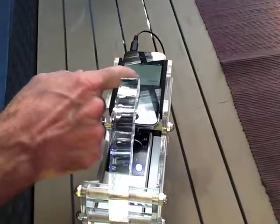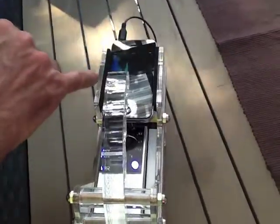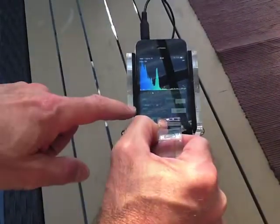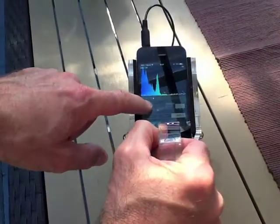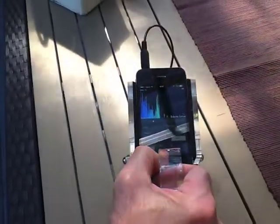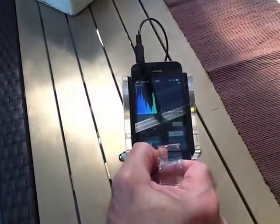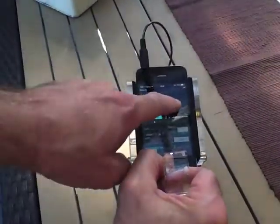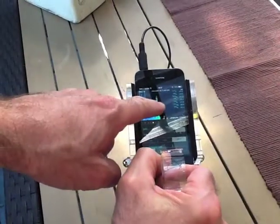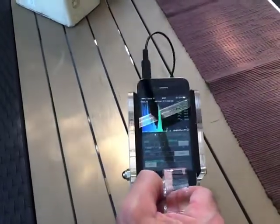Now if we flick across to the spectrum here — some reflection in the background — we can hold it at a better angle. We can see the Cs-137 peak coming up quite nicely there. It's amazing how quickly it comes up. If we actually reset that now and see how quickly the spectrum forms — you truly have a portable isotope identifier. Simply by using the isotope identifier on the side here, you can move your finger and see that we're on 662 keV, which means that what we've found is Cs-137.